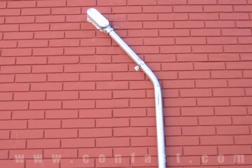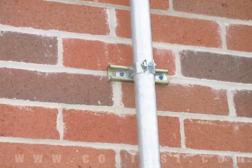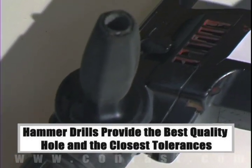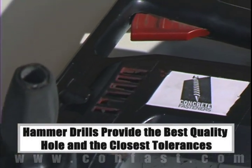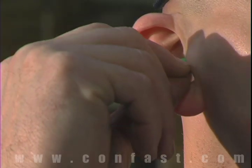If you're planning on fastening conduit to a brick wall, TAPCON screws are commonly used for this type of application. When fastening a concrete brick or block base material, a hammer drill must be used. Remember, always use eye and ear protection when using a hammer drill.